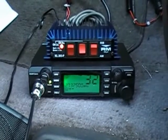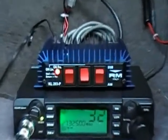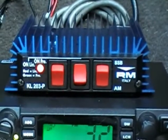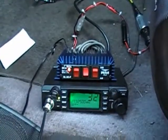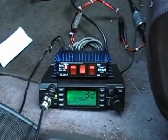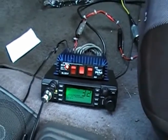All right, this is not a bad little radio. Right now I've got it set up for a two and a half watt dead key at 95% modulation on the AM. And perched on top of this — I'll zoom in here — I've got a small MOSFET amplifier made by a company called RM Italy, model number KL-203P. On a dead key I've got about 40 watts on AM, swinging to about 60 to 65 watts with the modulation. That's more than enough for the mobile, especially if you're only five or six miles apart talking mobile to mobile, and more than enough mobile to base.